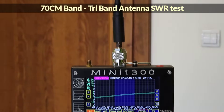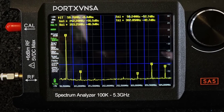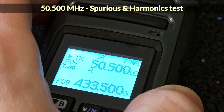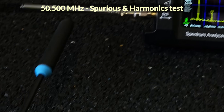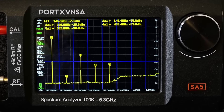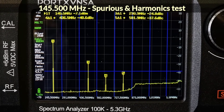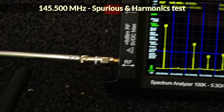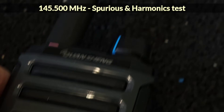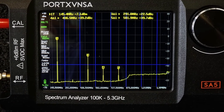This is pretty bad news for PMR band users. Finally, let's look at the transmitter harmonic signals on the 50, 145 and 433 MHz bands using my SA5 spectrum analyzer. Mark 1 is the fundamental frequency of the transmitter, and marks 2, 3 and others are its multiples, which should be at least 40 dB weaker according to the FCC. So all signals above the horizontal blue line are unwanted harmonic signals.